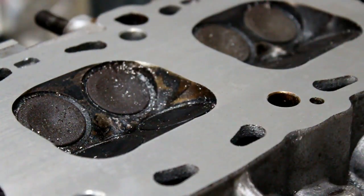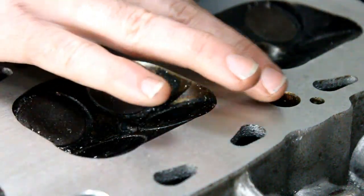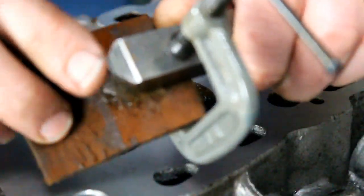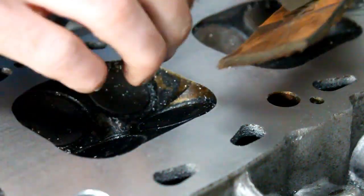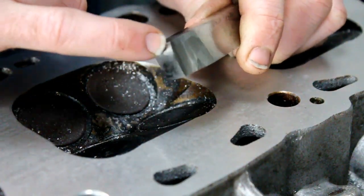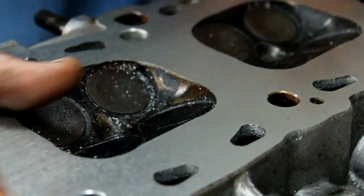Here's the surface. You can see it has a lot of little pit marks — it's cast material. There's a lot of discoloration and I think that's mostly in the material, not from the cutter. You can't feel any of it; it feels like a piece of glass. You can see slight step-over lines — this was ten thousandths of an inch with this cutter here, just a small raise. Very little relief, and the cutting edge held up really well. The cutter from last week has an abraded cutting edge because this is cast material with a lot of impurities. But I'm happy with this surface — it's more than satisfactory.